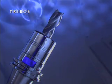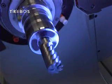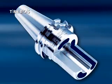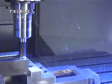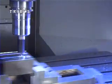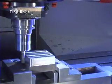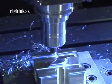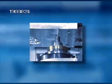Tribose R is the rigid version, developed with a focus on stiffness and high clamping forces. Tribose R offers the best dynamic run-out accuracy and low vibrations. The patented chamber system, filled with vibration dampening duroplastic, reduces vibrations and guarantees superior surface finish and longer tool life. Due to this superior dampening characteristic, degradation of the cutting tool edges is minimized. Tribose R is designed for high-speed cutting processes up to 55,000 RPMs.